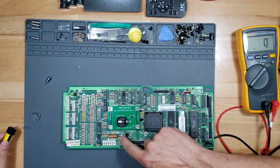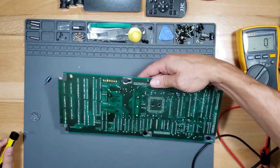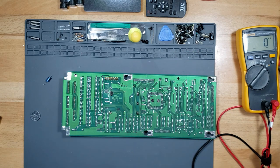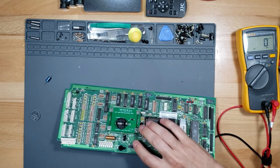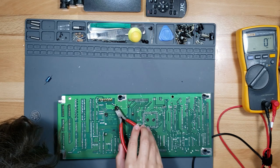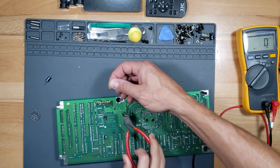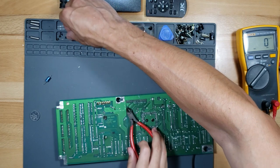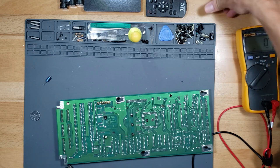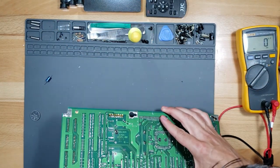Yeah, it went right through. When you have a double-sided board, you just heat it up, let the solder soak through, and it should solder on both sides. Watch your eye. Sometimes the solder will shoot out and might hit you in the face. See? That one flew somewhere. You got it. Perfect. So that is good.